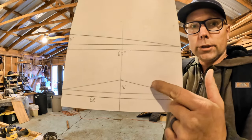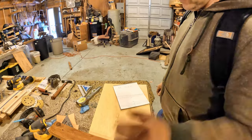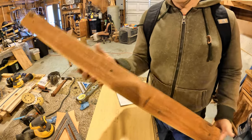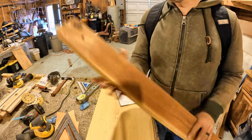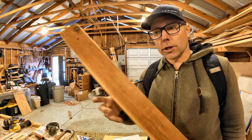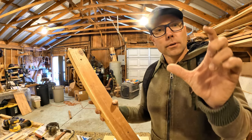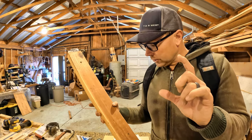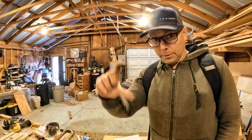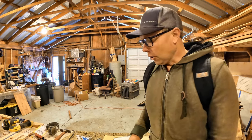Here's the design we're gonna be choosing — this one. Here's the material: I've got all this leftover redwood from a job. We're gonna make the redwood into trusses. I want it to hang over the ends about three inches on both sides. And I want the bottom of the truss in the middle to be 16 inches up. I think that'll be enough slope.